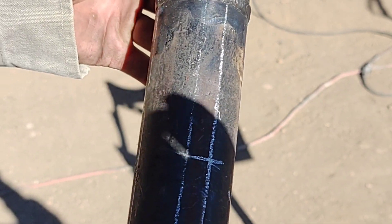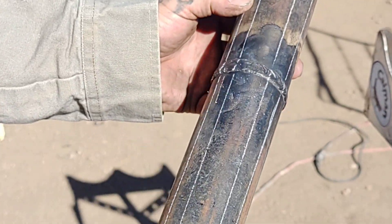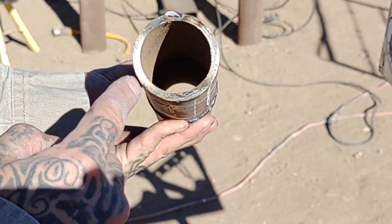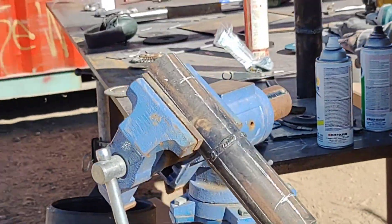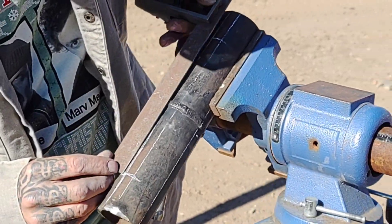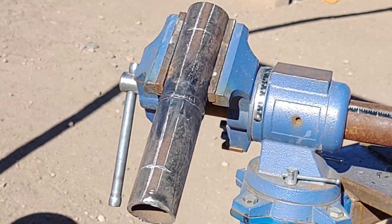Here's the test — I fired it up right here, and that's kind of considered my top, so I'm going to go ahead and cut my strap there and on the opposite side. I got a little bit of my button over there, but we're gonna have a root, a face, a root, and a face bend — so we'll have four bends out of it. First thing I'll do is measure it out. There's a certain half-inch diameter distance they want right here, and then this right here needs to be eight inches, because that's usually what it is to bend inside the strap bender. We're gonna make our little slots, cut our straps out, clean them up, and show you what it takes — demonstration, struck and tested.